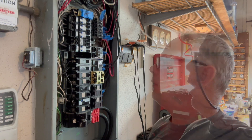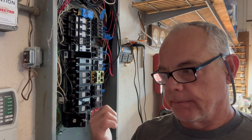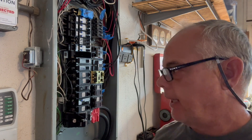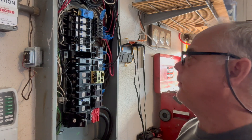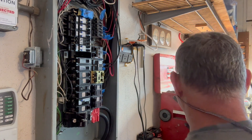I'm back at the electrical panel. We're getting a generator — well, we already have a generator. I've already have it set out there on the pad. But what I need to do here is separate the neutrals and the grounds.